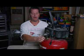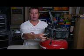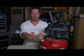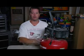Okay, so when you turn the knob, you can either back it down to around 20 or 30 psi, or whatever pressure you need, and you can turn it the other way and it'll make the gauge go up, and that way you can control it. You can control the pressure coming out of the compressor and get the right pressure going to your tool.